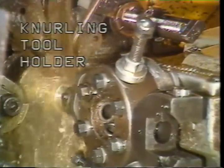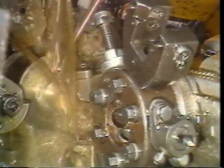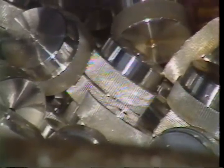As an operator of the Brown and Sharp Automatic Screw Machine, you will be required to set up, mount, and make the necessary machine adjustments for knurling. The process of forming a series of fine grooves on the outside diameter of a finished part is called knurling. The purpose of the knurl is to enhance the surface finish of a part or to provide a gripping surface on the part if used for a knob or lever.